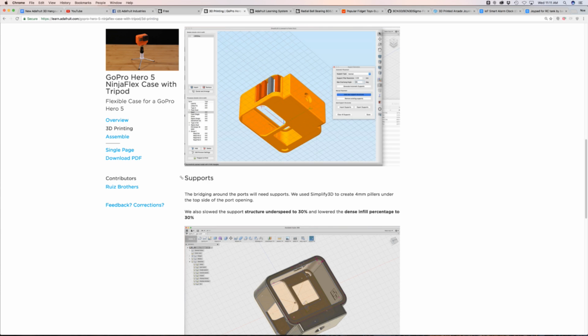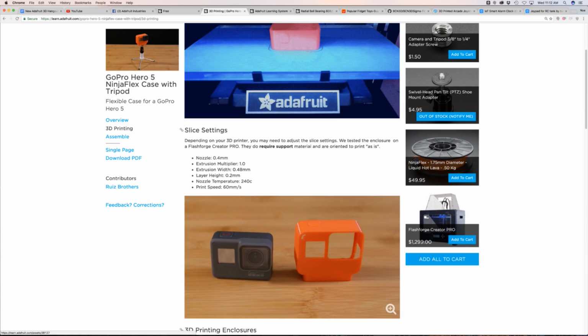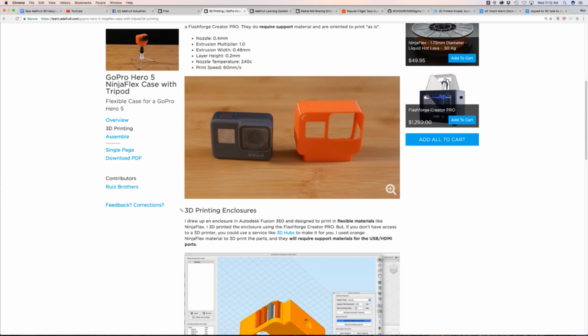Another thing is retraction, right? You could turn that off if you have under-extrusion. If it's not extruding enough, just turn off retraction. But in this case, you had it on. I just left it on, yeah. The Flashforge is able to do a good job with that. And because it has a spring-loaded direct drive, there were no modifications needed. You didn't have to install a new drive or anything like that. It's a stock nozzle. All stock. Great. Very cool. A lot of people can benefit from these types of settings. It'll vary on printer to printer, obviously, but for the most part it works well.